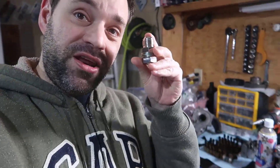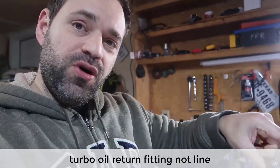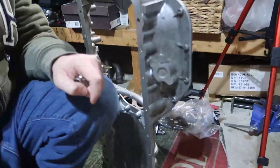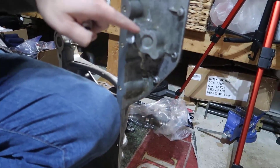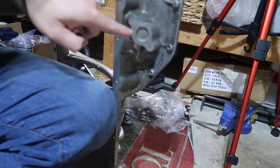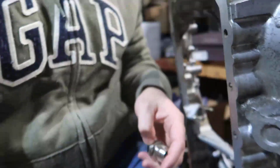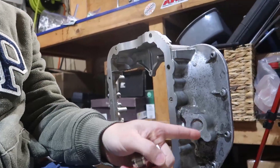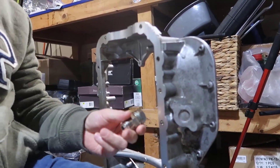Today I received a bunch of parts I was waiting for. One of them is the oil return line that we need to put into the mid oil pan, which is this guy here. Toyota has a pretty cool thing — there's this shape where you open the hole all the way and then you just poke holes, thread it, and this handles the screw. I decided to get a normal oil return fitting and I'm going to poke a hole in the middle, make the thread, drill it, thread this down, and then tie it from the inside. So yeah, we're gonna do that together now.